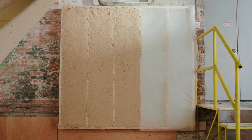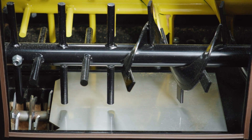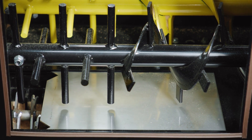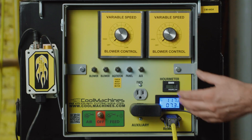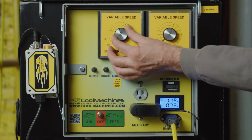In enclosed cavities like a wall or floor, the insulation must be compressed or dense-packed so it is self-supporting. To accomplish this compressed install, we reduce the gate to allow for greater back pressure. Sidewalls might require a low to medium airflow and only one quarter to one half open gate.